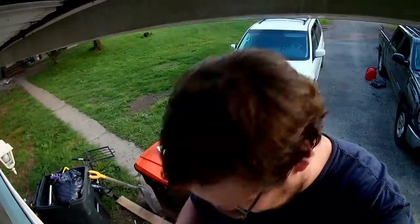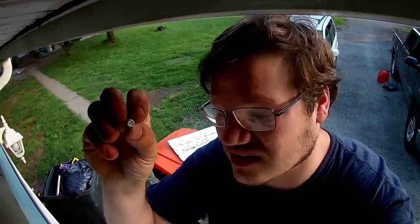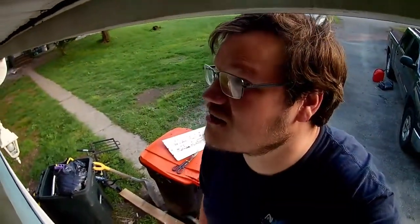Maybe you guys have already put your soffit up and you're saying, hey, it falls down every year, I just pop it back up, it's really annoying. Get those pretty white head screws. You find them with the gutters. You could come into your soffit and put it in at an angle and it'll be exposed. Just make sure you go in the ridges or the low parts of the soffit. It's not the prettiest, but you know it's going to work.